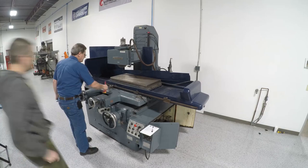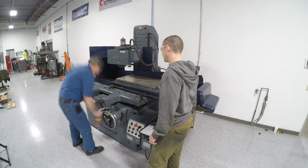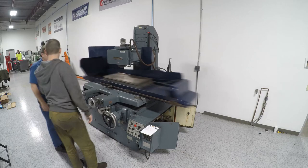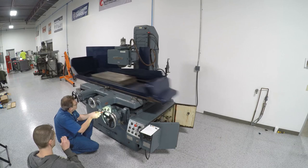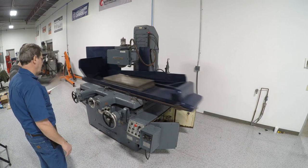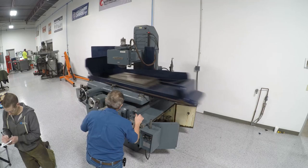It was actually an older machine than he'd ever worked on himself. He is an Okamoto service tech, so he knows Okamoto machines in general, but he saw some things that were similar yet different — like, 'I've never seen a mechanical switch on this before.' He knew how to get it up and running, which I couldn't do after we brought it back, mostly because you had to have the levers in certain positions. That was a huge confidence booster. He looked at the hydraulic pressure and told me it only runs at like 200-something PSI, which is nothing for hydraulics, checking how many amps the motors were pulling, looking at the sight glass, and checking the gravity-feed lubrication system.